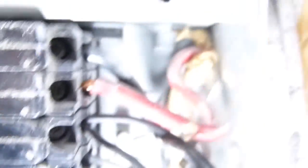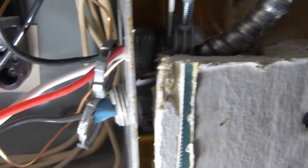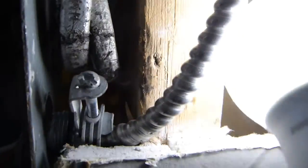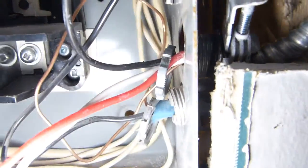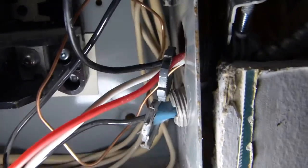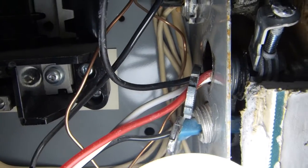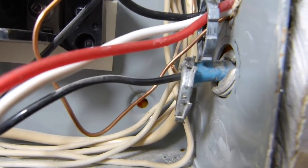On the other side, however, the story changes. You can see that some of the wires have this paper insulation showing on the inside — so far, so good — but when you get down here, you can see that the lowest one is blue, and the one above it is an armor cable. The questions you should be asking at this point are: what are those two, where are they leading, what are the loads on those circuits, who inspected those, and where is proof of inspection and approval? Let's follow that blue jacketed wire — potentially unsafe and problematic.